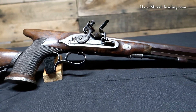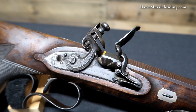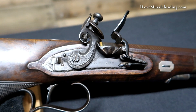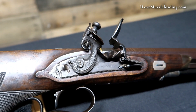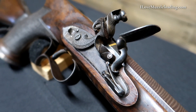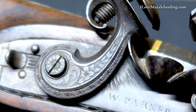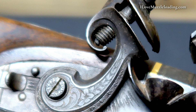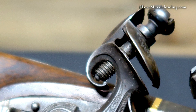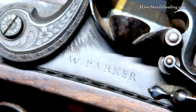The lock is a beautifully executed English style lock with sunburst engraving at the tail, and a small safety catch lever with more sunburst style engraving. The cock of this lock is fully engraved and has beautiful shaping — a tail comes off the bottom jaw and wraps around scrolling to encapsulate the cock screw that holds the flint in. The top jaw is engraved with a classic sunburst pattern emanating from the bolt screw. Each visible face of the cock mechanism is engraved with a running leaf border, floral patterns, and scroll work. Forward of that, emanating from the pan, we have more sunburst patterns and the W Parker name engraved into the lock plate face.